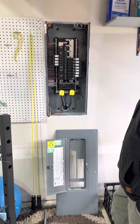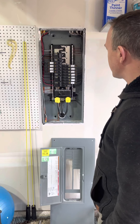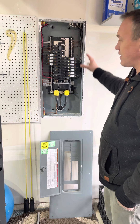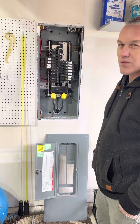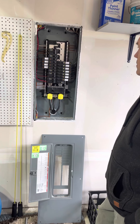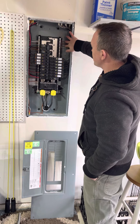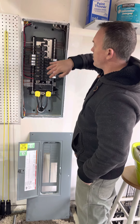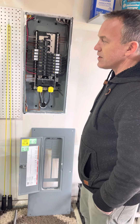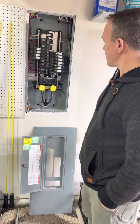As far as looking at your electrical service: if it's nice and tidy like this, generally a lot of the house will be tidy too. If you see a complete mess of wiring, that's often a red flag for what's behind the outlets. Regarding floating bus bars — that applies to sub-panels. On a sub-panel, you should see ground on a separate bar and neutral on its own; they need to be separate. That's code now and best practice, though it's more of a nuance in electrical wiring.